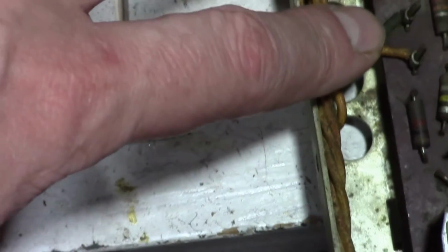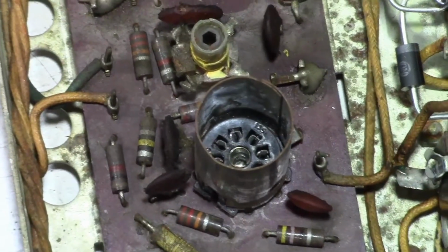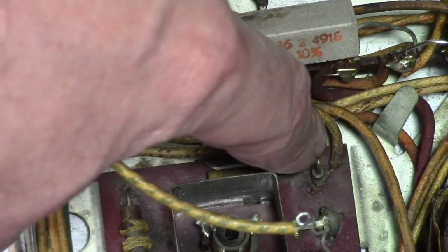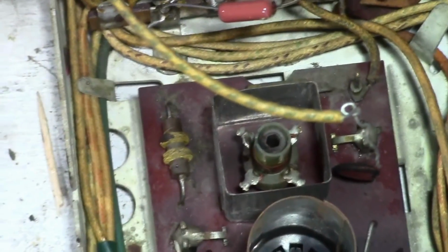To get the board out, same deal. Stakes you have to undo, and some wires, but there's only a few. I think there's only 3. That's for the filament power and B+, and I think AGC bus. And then of course the output, which I do believe is this wire here. It goes over to the main board and has sound and video on it after the detector.